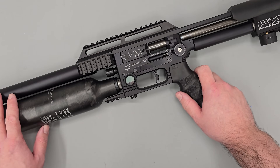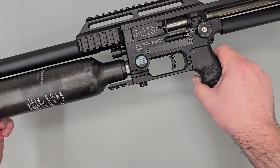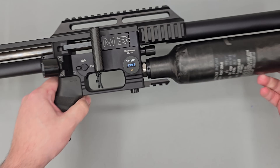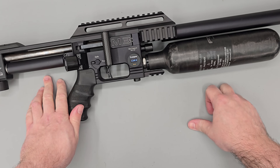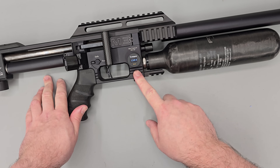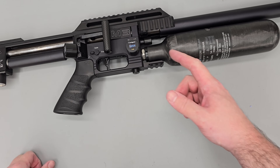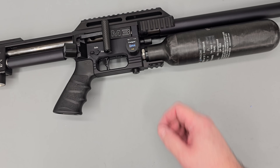The rifle is now gassed back up. Looking at the gauges, the first reg pressure one is reading, and on the other side the other gauge is reading as well. Both gauges are working exactly as they should. The installation procedure will be the same on 90% of other rifles — check what sealing device is used and try to reuse it; if not, you do get a couple of sealing o-rings and a new X-ring in the kit.